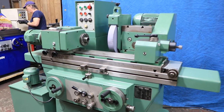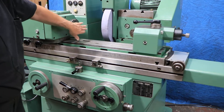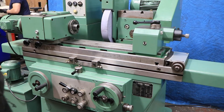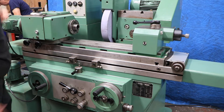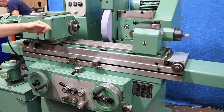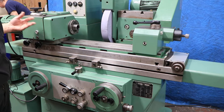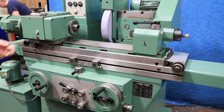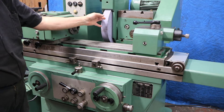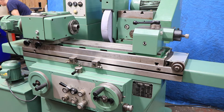When you want to get accessories for this, they are available to either screw onto that thread, or as a flange or faceplate that will go into that number four taper and be locked in from the rear with a drawbar. This is also a live and dead center, so you can run this as a live spindle with a chuck on it, or as a dead center with a driving plate for between-center work. This has a 14-inch grinding wheel, and it'll take at least a two-inch wide wheel on there.